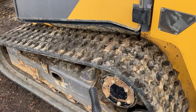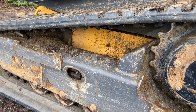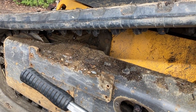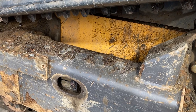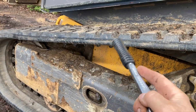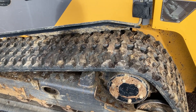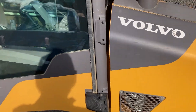When we look at the tracks, we can see the tension system behind this — normally there's a plate here but I removed it to show you the system. There's a zerk fitting, the grease fitting, to add tension and push the front idler forward. If you want to release tension, there's a nut — on my machine it's a 7/8, though it can vary. You unscrew that nut and a lot of grease comes out, then you push on the tracks and they retract. My machine came to me with far too much tension on the tracks, which was bad, but I fixed it up. I'm not sure what this other part is yet, but we'll figure it out.